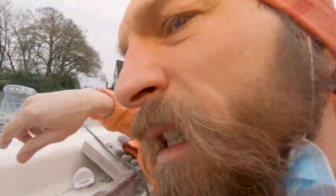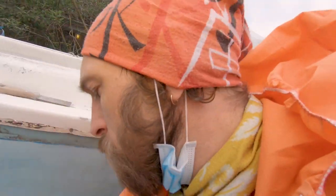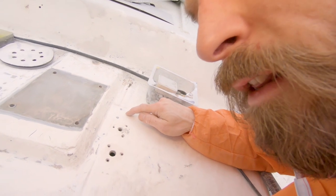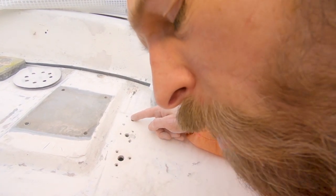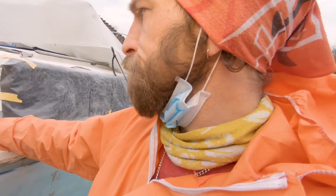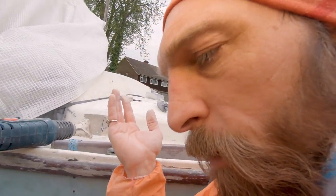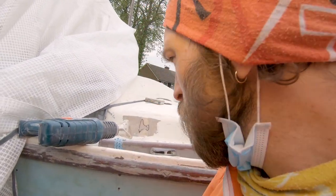And what I've just seen on the other side, this is a bit conjectural, like I might be making it up, but it seems to make sense to me, is in cleaning up a couple of radio connections that used to come through the deck, and fixing those, there's this other very perfectly round and grey, clearly a filled hole there. So I've just made some investigations, and it doesn't seem to be filler, it's not at all loose, it was very perfectly finished. This side is quite hard. I think it may be formed underneath with fiberglass, made hollow and then drilled from above and filled with some kind of a putty or resin. And here there's an air bubble.